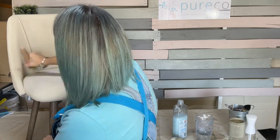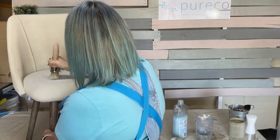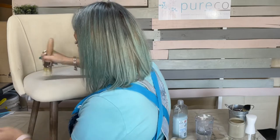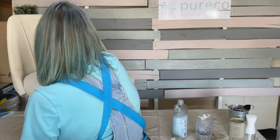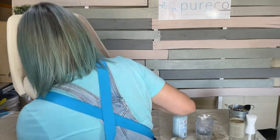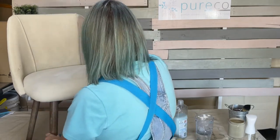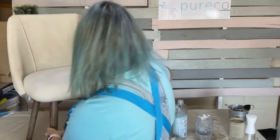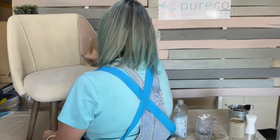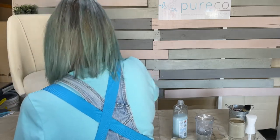The reason I chose white wax is because I didn't want it to look flat — I wanted to add a little dimension. The tint in the white wax will grab in different areas and give it some variation. Once I've finished waxing and let the wax sit for a while, I'll do a bit of a buff with either a brush or a cloth to pull off the excess, just like you would on furniture.